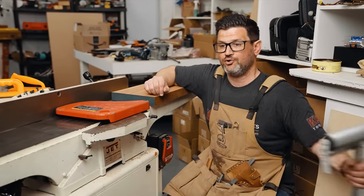Don't buy benchtop jointers brand new — they're like $400 and you can get a used jointer on Craigslist for $400 to $600. They're just not accurate; the outfeed table is 18 inches at best, so it's not going to be very accurate unless you only do very small things. One tip I forgot: if you want a really tight glue-up and you've been having a little gap, it may be that your jointer fence is a little out of square. The way you can fix that without adjusting your fence at all is to run opposite sides of your parallel boards against the fence. For example, run the top of board A face-out, then the bottom of board B face-out, and when you fold them together, whatever angle your fence was at will equal 90 degrees and you'll get a seamless glue-up.